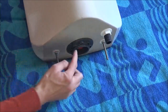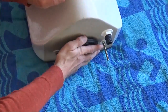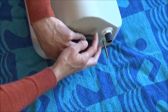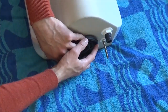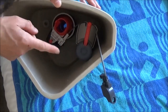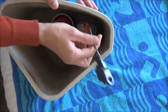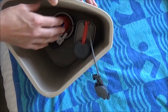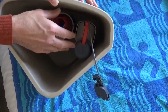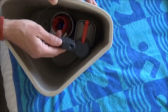Before we fit this into the toilet pan, you then need to add another rubber washer around this nut — just force it over and that creates the seal between this and your toilet pan when you secure them together using these threads. So if you look inside, you can see the cistern, the float chamber, you can just about see the two screws that we've put down through the bottom. And here's the cable for your flush. In this particular example, we're a bit tight for space because it's a corner unit. When we attach this to the toilet, I may have to make a few fine adjustments inside here just to ensure that this cable lines up with the button for the flush.